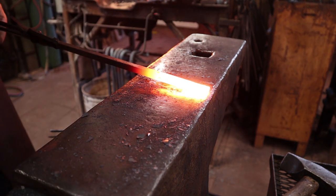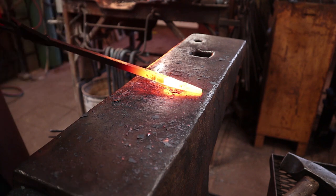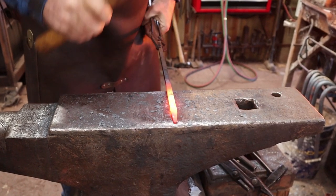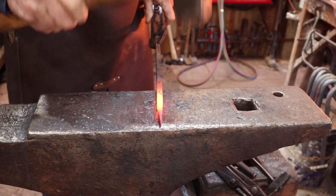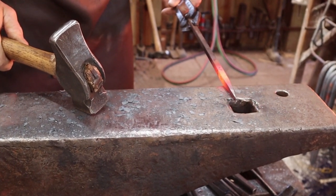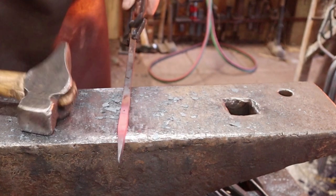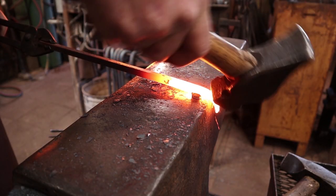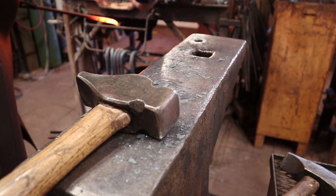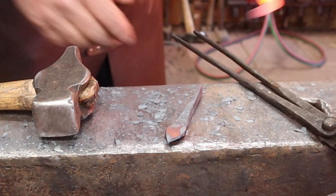On this bar I just want a little short taper — I think I'm going to do it as a parallel taper as well. I can find a mark on my anvil to see how long that is. I'm going to give this just a little bit of a scroll over effect there. That will sit right in there like that. I'll do the same thing to the other end.